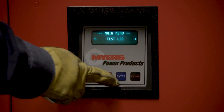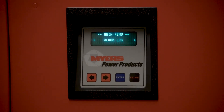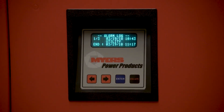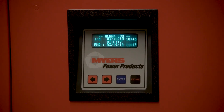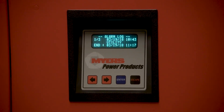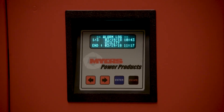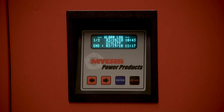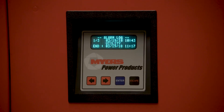You can also see the logs such as test logs, event logs, and alarm logs. Alarm logs hold alarm faults that have been recorded by the unit. In this instance we have a utility fault. Utility is a power loss and on this unit is qualified as a fault, and shall be recorded and kept track of. During factory maintenance these logs are erased and recorded for future reference.